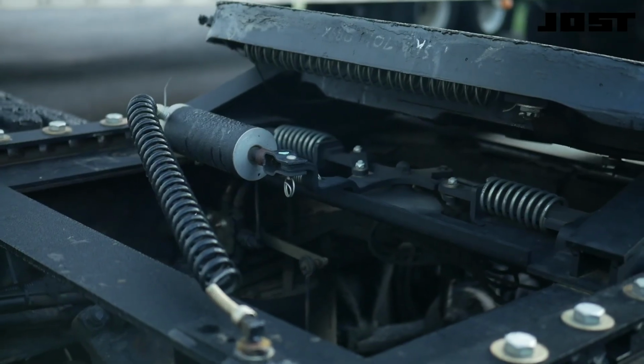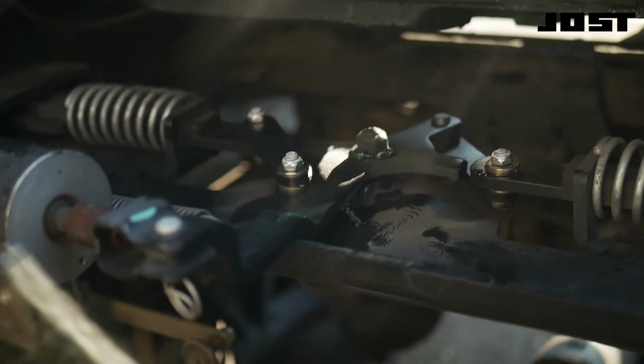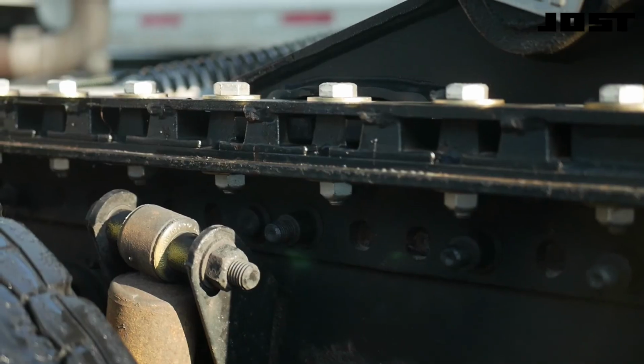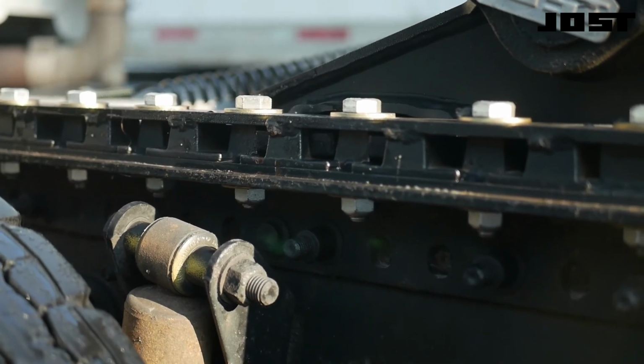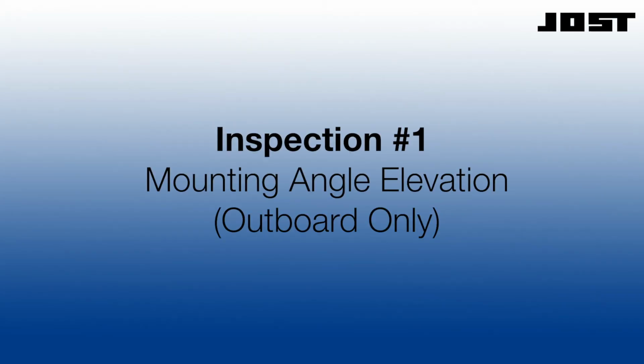The cylinder is fully retracted. The pivot arm has rotated to face forward. The locks are rotated between the extended locking plungers. The locking plunger teeth must engage the rack.